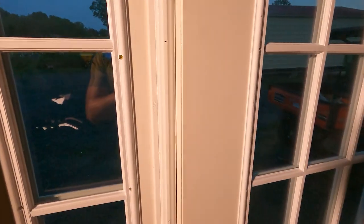Awesome — what do you think? Pretty nice door, huh? I think that's going to be an awesome addition to the mega shop. Thank you so much for joining me — that's how you install a door. We learned a few lessons today: a little bit about putting shims in, and also about screw length — my screws are not quite long enough. I need to go back and get screws about a half inch longer — I think these are three inch and I need three and a half inch. Be sure you plan for a trip back to the hardware store, because you'll always need to do that. This is the farm office door — hopefully some of you guys will be coming through this sometime when we have classes here on the Stony Ridge Farm. Thank you, we'll see you next time, take care.